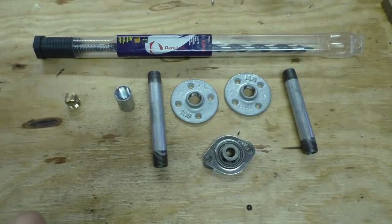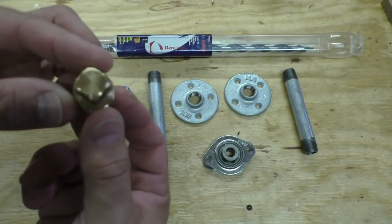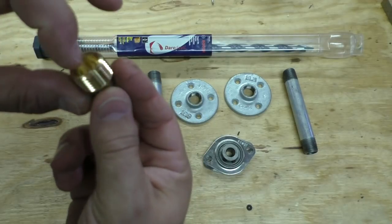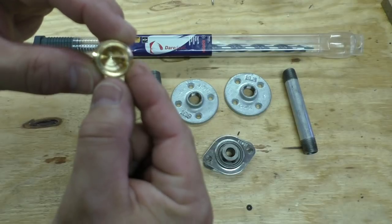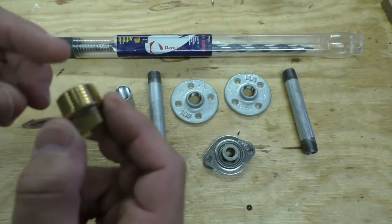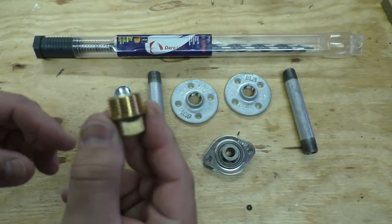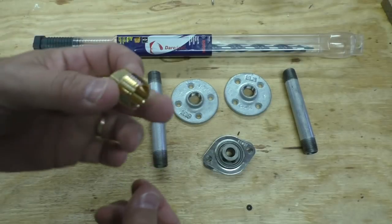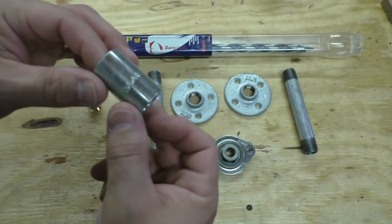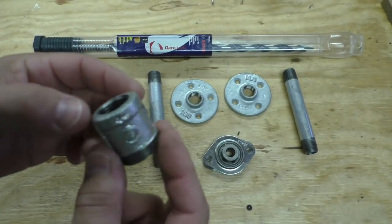This is going to build the entire extruder mechanical part. What I've got here is a brass plug, and I like this one because the inside is cone-shaped, so when I put my drill bit in there it's going to send it right to the center. All of these pipes are half-inch NPT — that stands for National Pipe Thread, your standard plumbing thread. This is a plug, and this here is a coupler.